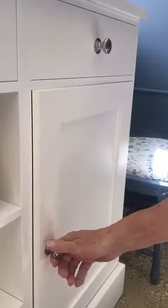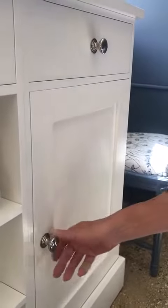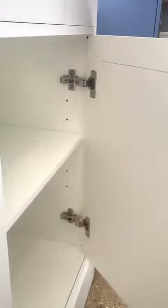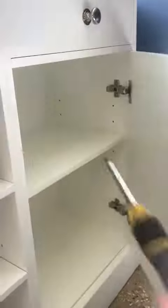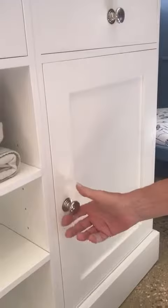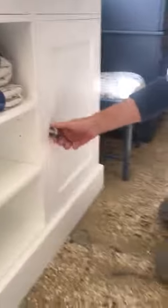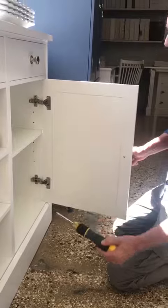This one is rubbing slightly at the top because we've got an uneven gap around the edge. If I tighten up this screw, you can see the door starting to move forward. What we're trying to achieve is an equal gap all the way round. At the moment it's still a little catchy, so tighten it up slightly more. And there you go — the door shuts perfectly on its own. So if you find that your doors are rubbing slightly at the top or the bottom, use these two screws on the hinge to adjust it to suit the levelness of your floor.